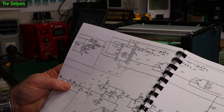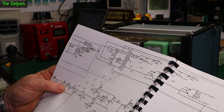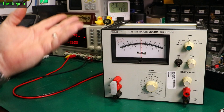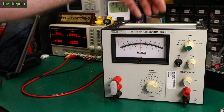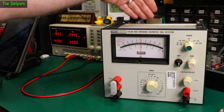We've got some voltages to check, but unfortunately some are inside the metal can, so those aren't easy to access. I can check the stuff outside the can. I'm going to hook up to the DC supply instead, since the battery pack's been removed but the connections are still there. I've hooked up the power supply, set to 9.4 volts — just below the nominal battery pack voltage — so it should still give us an indication of whether it's a main system problem inside this box or a power supply problem.